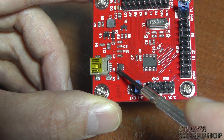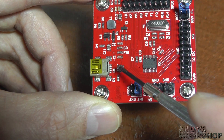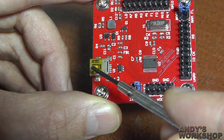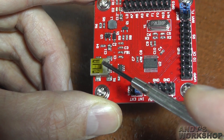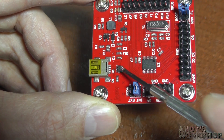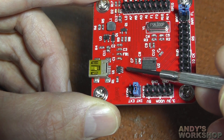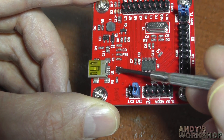That is a USB LC6 anti-static IC — it's just to guard against damage from the USB cable being repeatedly plugged in and out. You could easily damage the MCU through static if you didn't have one of these in place. You can see the schematic for this on my website. I do recommend that every USB design has one.